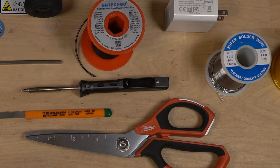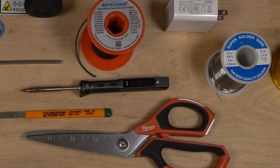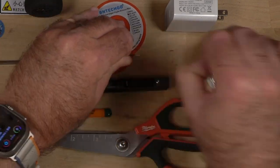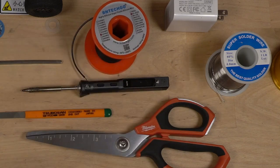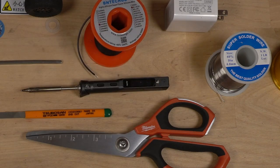Silicone wire. I have converted everything that I wire myself these days to silicone wire — the sheathing is silicone. Why? Because I can strip it with just my fingernails. I can grab the wire and strip it right off. The wire is stripped — it is wonderful. I don't have to use wire strippers with silicone wire. Get yourself some silicone wire. You'll thank me.